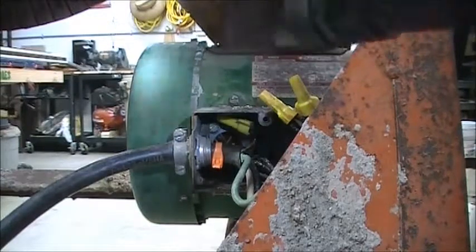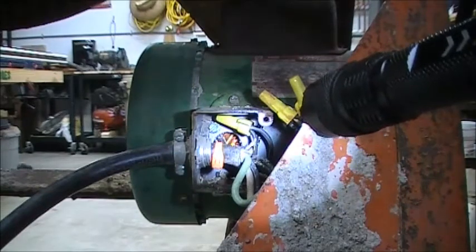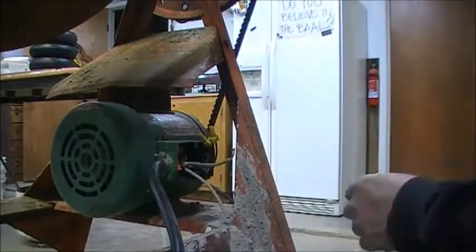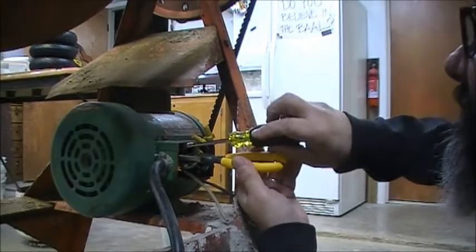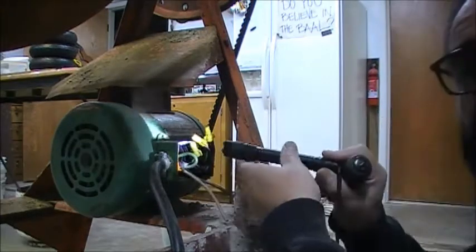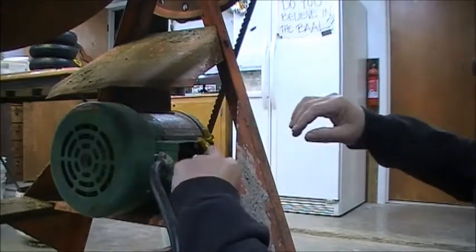Another thing that I was always told is you connect the ground first, then the white, which is neutral, and then your hot, whether it's red or black, you know. So that's what we're gonna do, and it's kind of tight quarters, so you're gonna see it from long distance away. That was actually easier than I thought. All right, cool. Hopefully everything else goes that way. All right, so let's shove that one in there. Now let's go with our neutral.